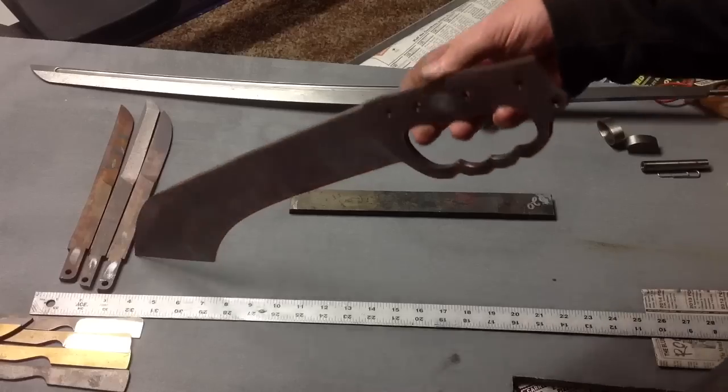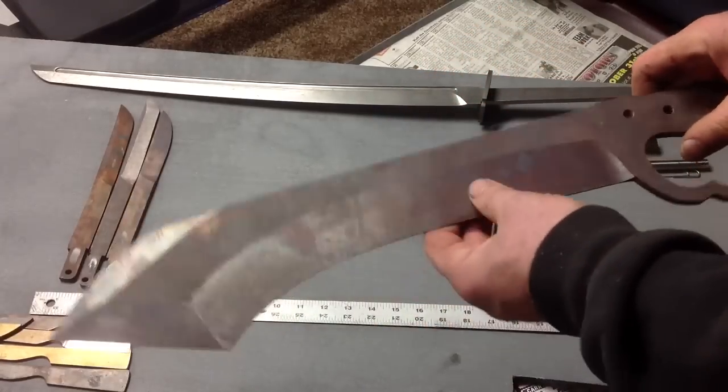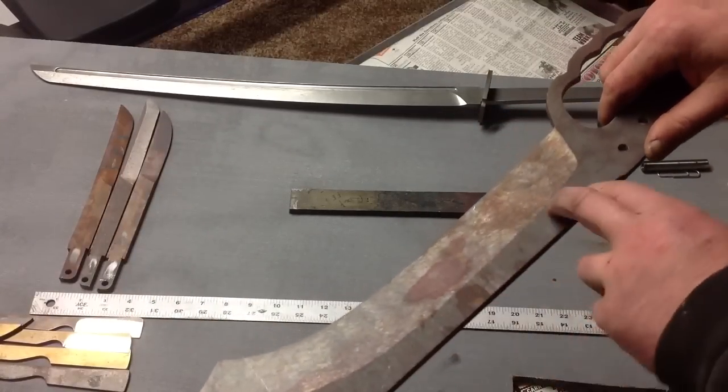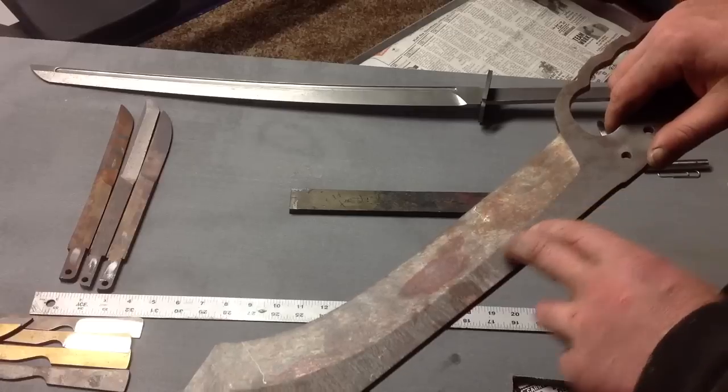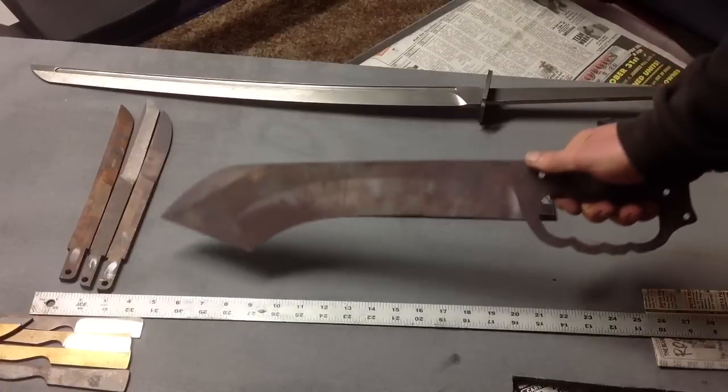This is about 300 thousandths 3V, heavily ground in these areas. If I find the weight is too unwieldy, I'm going to go back and fuller these areas — grind out on some different fullers if I really need to change the weight distribution.